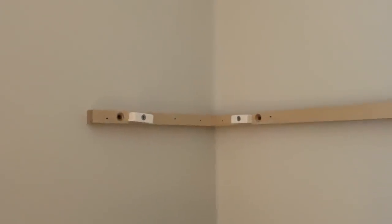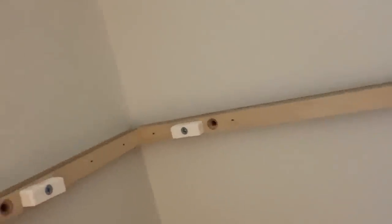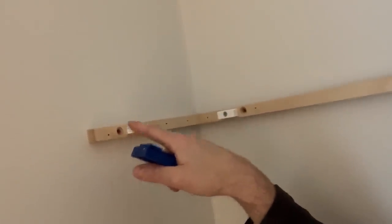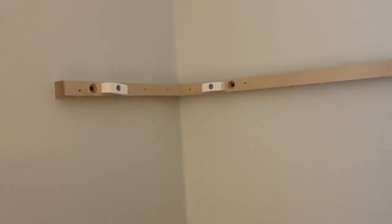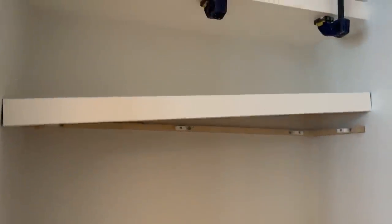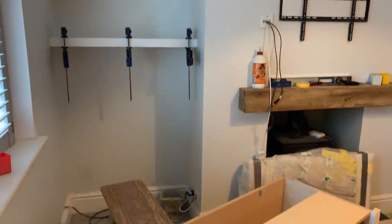Pin them on, level them — they're pre-drilled with 6mm holes, countersunk, pre-fitted with modesty blocks and 25mm screws. I'm going to through-drill that 6mm hole, put a red UNO plug in, and put a 60mm screw in. Then fixing them and trimming my shelf parts to fit. The shelves are in, so now it's time to refit these cabinets — the customer's helped me carry them back in.